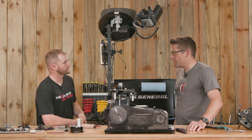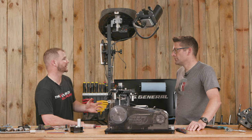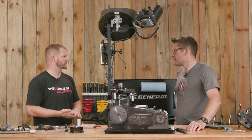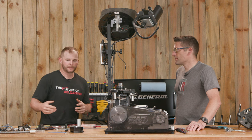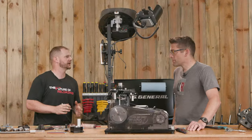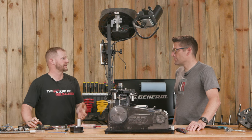Starrett — S-T-A double-R-E double-T — that's a tool and instrument oil. Any lightweight machine oil will be fine. I used gun oil for my first few years with the machine; as long as it's pretty light and spreads well, it works. People ask about lubricating the driveline — a big part of that is your daily lube up top. It seeps down, coats everything, and saves you from having to get into the guts of the machine every time.